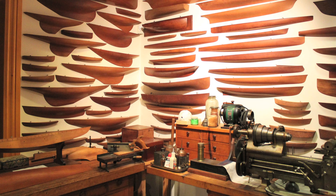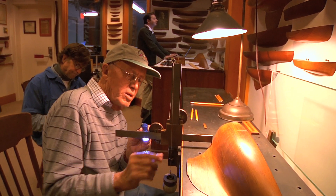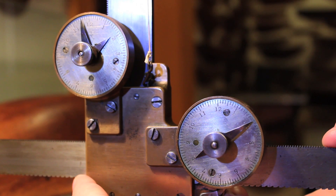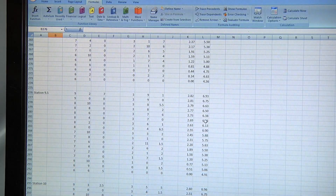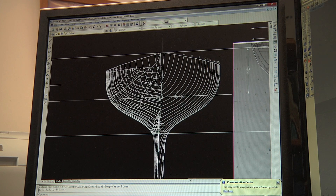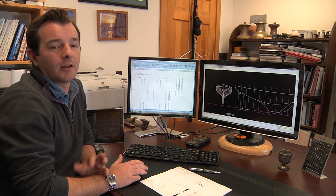When we lift off in the model room, taking the two-dimensional offsets off the model using Captain Nat's offset reading machine, we transfer the numbers into a spreadsheet, which we use to convert them into two-dimensional lines that represent each section of the boat. These lines each represent essentially a frame in the boat, and that's what defines the hull shape.